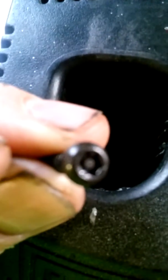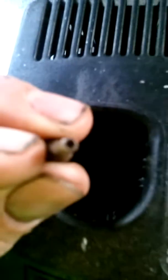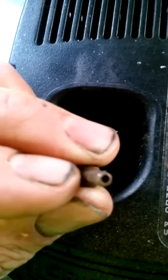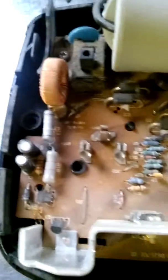So I took the cover off from underneath — there are about six screws. These are security Torx, or security Allen, same thing, just ones with a hole in the center. You need the security bits with the hole in them. It's got a hex head with a hole in it. I took those off and put the battery in, but still couldn't figure out why it wasn't charging.